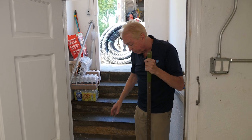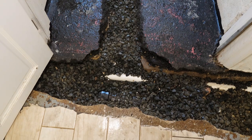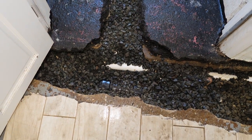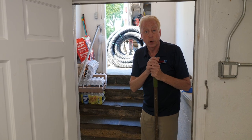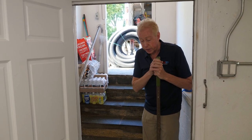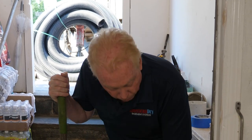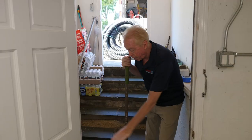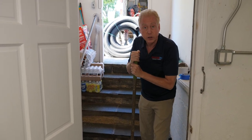Once it's all re-cemented, we pull the tape off. We're taking this outside drainage and, once again, tying it into the inside drainage so no amount of water here will ever build up and flow inside the house like it was prior. One of the main reasons they were getting basement waterproofing is that, from what I understand from the homeowners, they got water about this high in the basement after a good heavy storm.